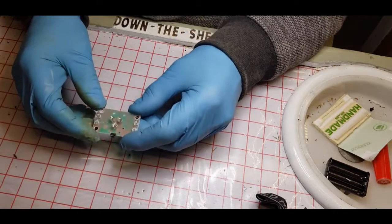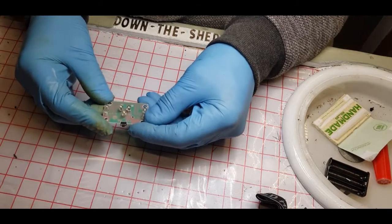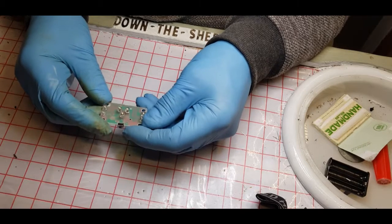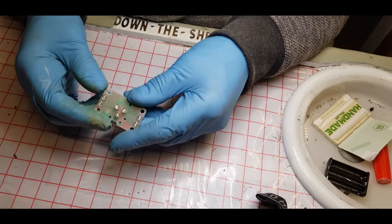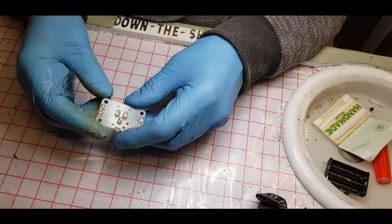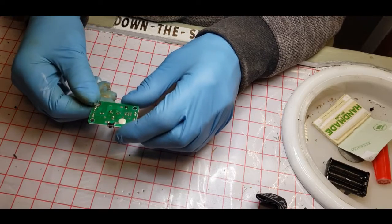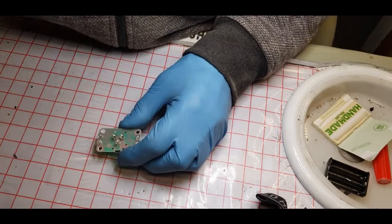And there we are with the 3 LEDs. Might even change the red ones to greens actually. Are they 3 or 5 mil? They're quite short. So let's just get these desoldered out and changed over, and we'll look at the results.